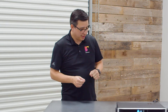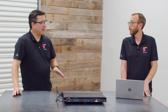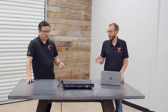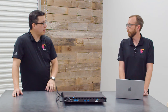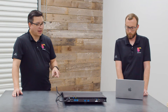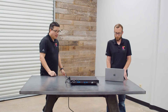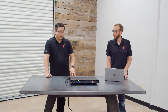The other cool thing is how you control it. There are a couple of ways to connect. If you've got a facility network, you can just plug in a network cable — it's DHCP by default. You could also plug in a wireless router, join that SSID, and connect that way. The last way: this amplifier actually has a wireless access point built into it. You push this button and it turns on the access point inside the amplifier, which will pop up as an available network once this light turns blue.